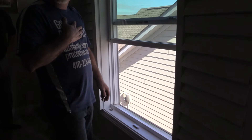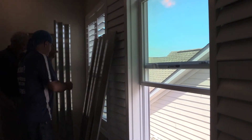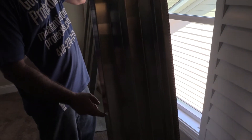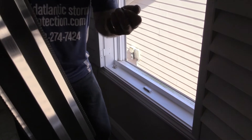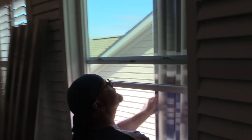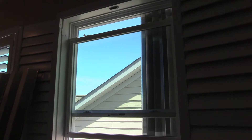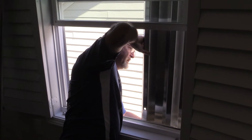Since I'm right-handed, I'm going to start with the right panel. The right-hand panel has the hole towards the center — no holes on the far side, just a hole here towards the center. I always grab two wing nuts because you will drop one. We take the panel through the window, back down on my knees, tuck it in the top header, slowly position it over the bolt, tighten up the nuts starting with the center bolt first — that keeps it from falling side to side.